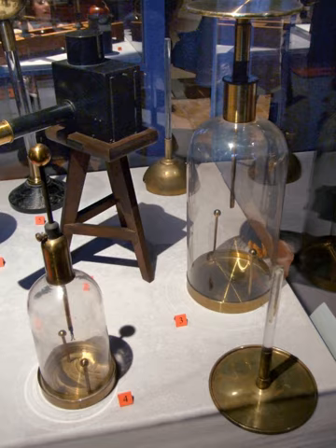The gold leaf electroscope was one of the instruments used to indicate electric charge. It is still used for science demonstrations but has been superseded in most applications by electronic measuring instruments. The instrument consists of two thin leaves of gold foil suspended from an electrode. When the electrode is charged by induction or by contact, the leaves acquire similar electric charges and repel each other due to the Coulomb force. Their separation is a direct indication of the net charge stored on them. On the glass opposite the leaves, pieces of tin foil may be pasted, so that when the leaves diverge fully they may discharge into the ground.